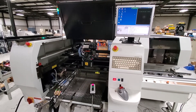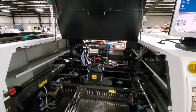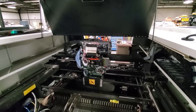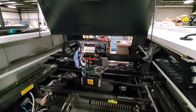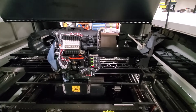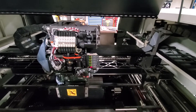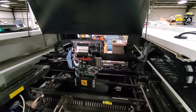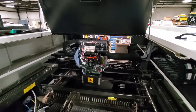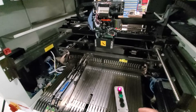This is a second demonstration of the GSM. In this demonstration we're running a second head — a head that was rebuilt secondary to the one shown in the first video. It was completely rebuilt: all new belts, every factory setting checked and readjusted, including all the touchdown sensors, Q0, Z0, full calibration of the touchdown sensors using the factory jigs, all functions checked, put on the machine, all the mirror settings checked and reset. In this video we're going to show it running production to demonstrate that it is fully production ready. We're going to go ahead and bring in our board.